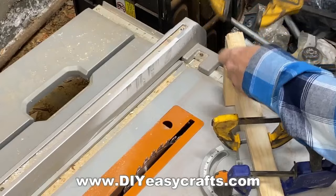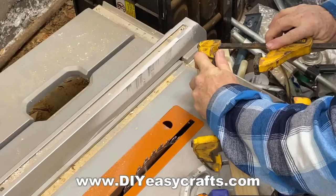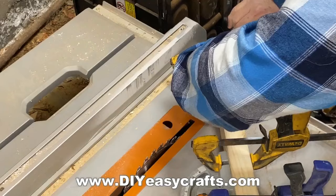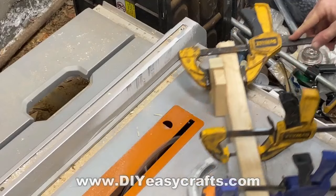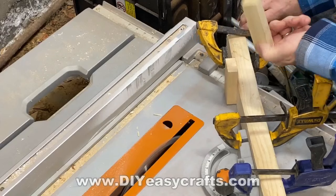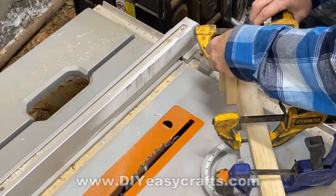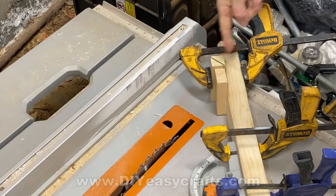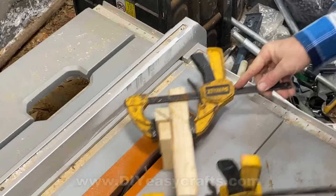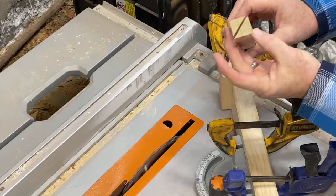The hardest part of the whole job for most people is going to be cutting the hubs. These are the spinning hubs, and they have to have a 45 degree cut on both sides, kind of opposite each other. I made a jig on a table saw. I attached a 2x3 to my 45 degree, and I also screwed on a piece of scrap wood so that I can put this squared stock one by one and clamp it into position, cut my slot, and then put it right back on. I can rest it against that scrap piece of wood screwed to the 2x3 to make sure it's perfectly square. I'm going to clamp it into position. The next 45 is cut on a different corner, so that one 45 is going from one corner to one corner, and the other is going from the other corner to the other corner. The wings have to be opposite, and you have to make two of these.